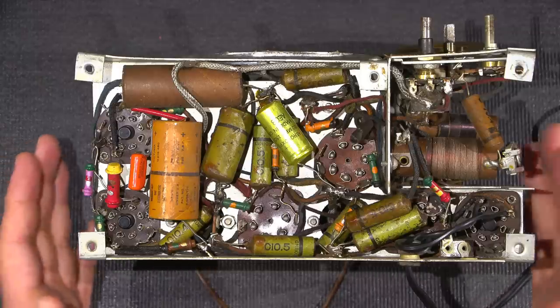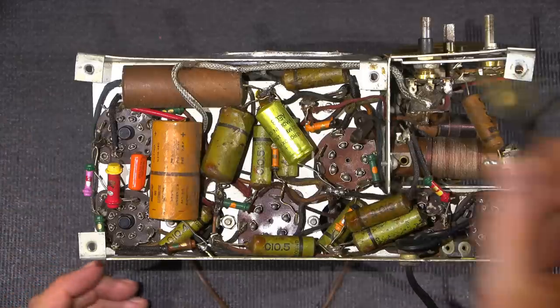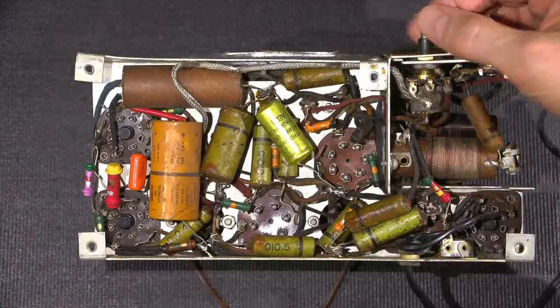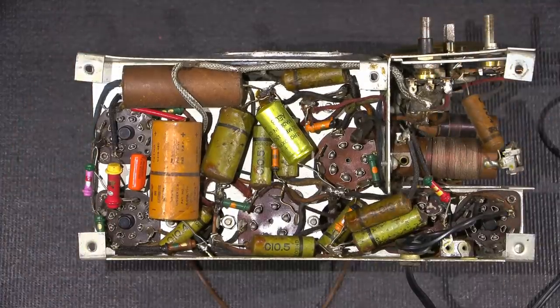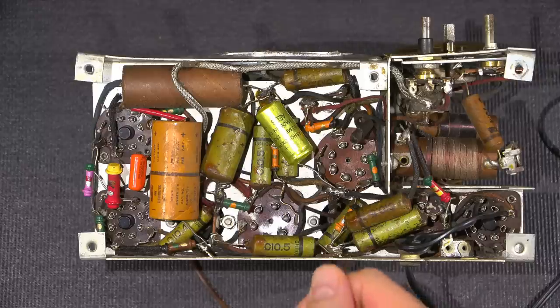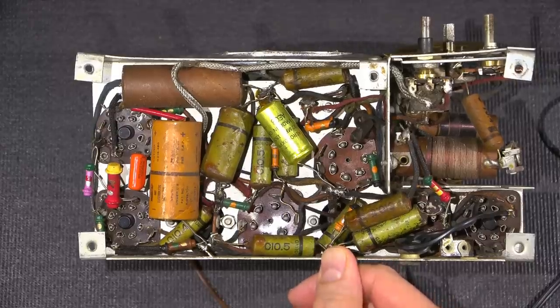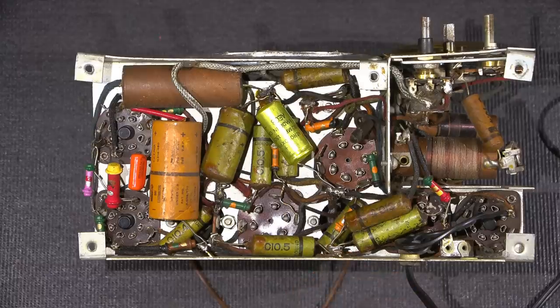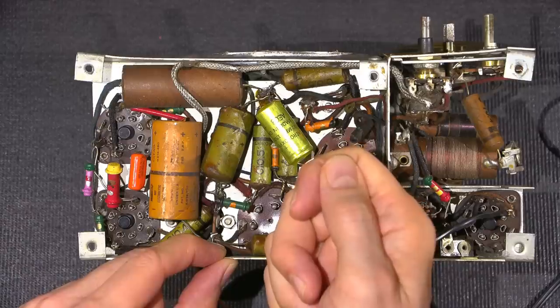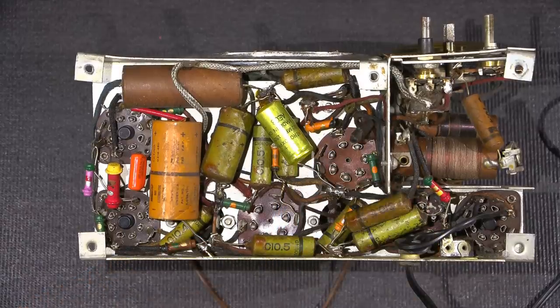So for example, if this thing was plugged in and you had a polarized line cord like this, and it was wired correctly, and you shut the radio off, if you were to take the common lead of your oscilloscope probe and touch it to the chassis, you would turn the radio on. If you were to remove this, you would shut the radio off. If, for some reason, you came between the chassis and the oscilloscope probe, you would receive a pretty nasty buzz.